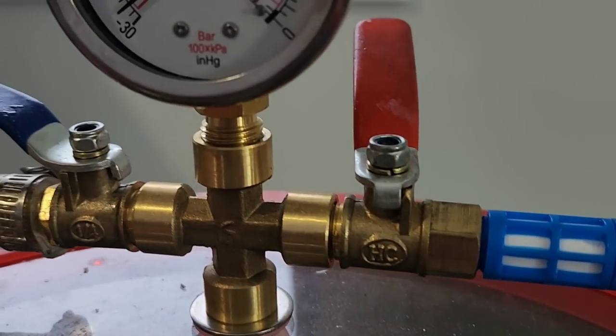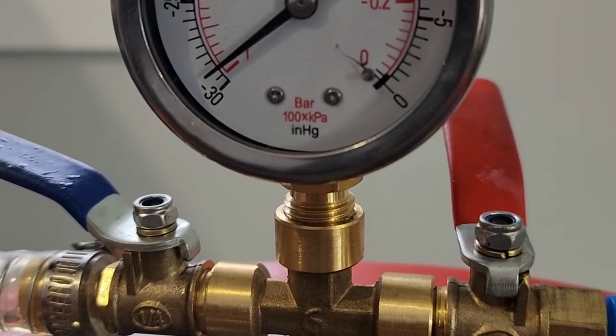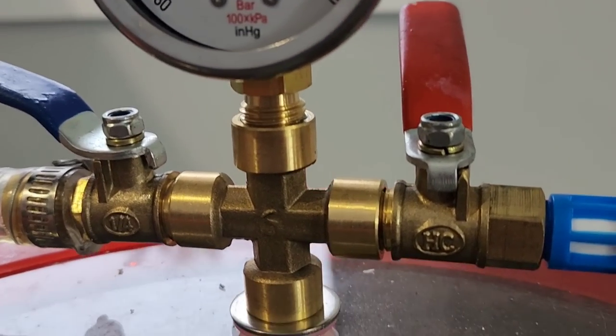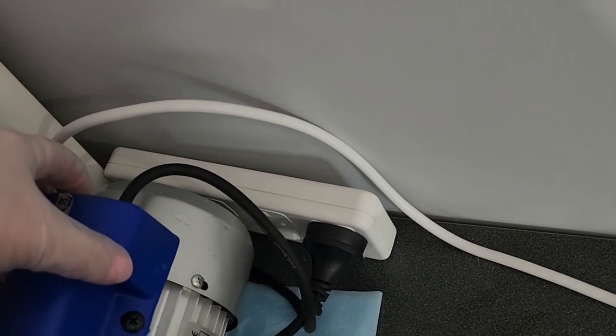So what I'll do is, once it gets to, I don't think it's going to go any lower on this particular instance. So I'll just turn the vacuum chamber off and I'll leave it in there for 5 minutes, and it will just keep vacuum, it'll keep sucking the bubbles up basically. So yeah, that's what I'll do. I don't think it's going to get any further, so I'll close that. I will turn that off,